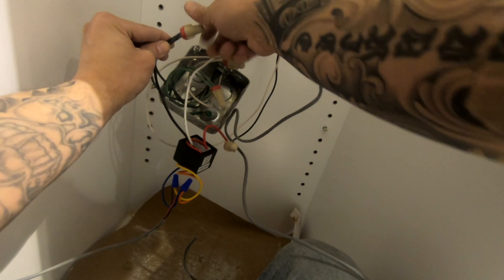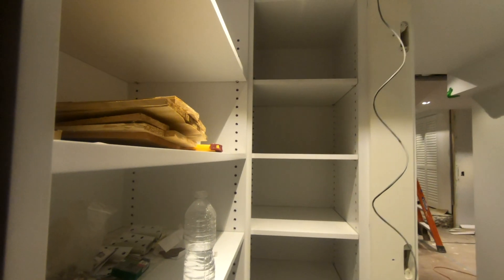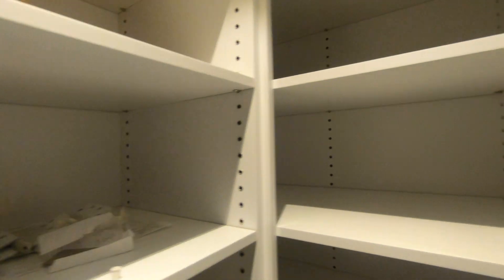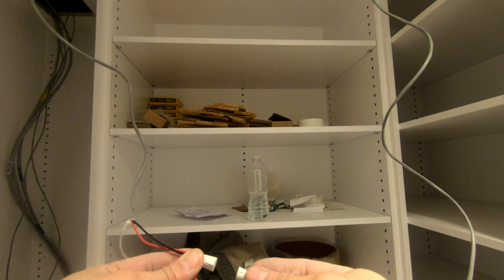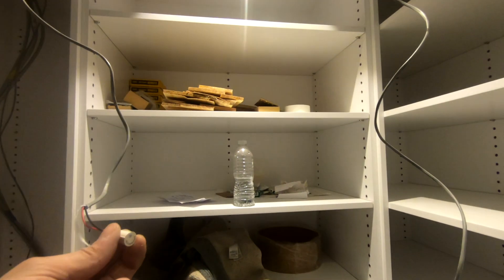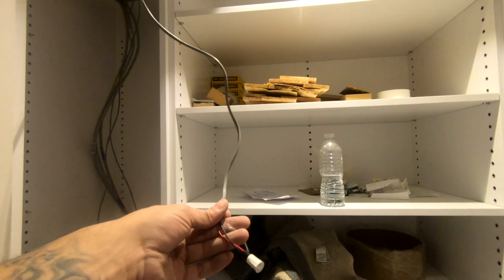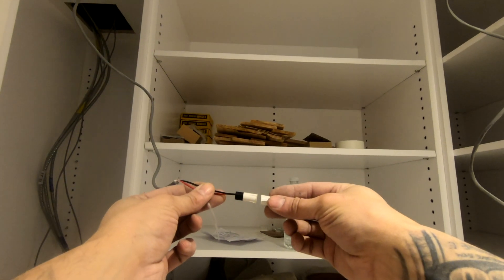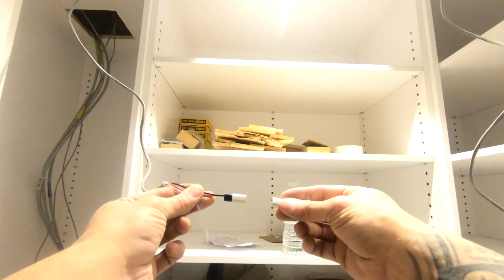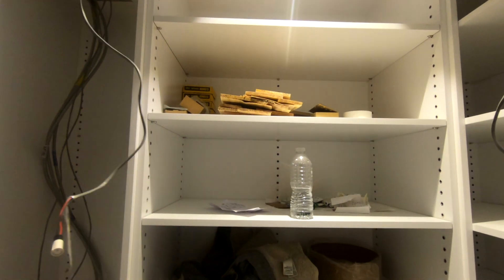This is what's going to give everything power. As you can see, the light immediately turns on because the magnetic door contacts are not touching. Now once you touch them, it becomes a normally open application, which is what turns the light off. The magnetic contact goes inside your door frame - that's the one with the wires. The one without the wires goes on the actual door.